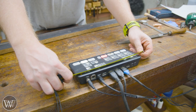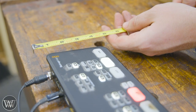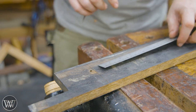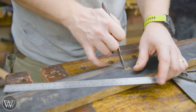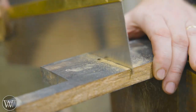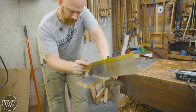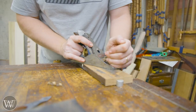So I need to make it three and a half inches tall. How wide do I need to be? I need it to cover the ATEM Mini, but I also need space for pieces on either side, and I want those legs to be a certain distance long. It's basically going to be a three-sided box that covers it up. We're going to make it out of White Oak — specifically some 100-year-old White Oak. This came out of a desk I saved from a pile a long time ago and I've been slowly using it. 100-year-old White Oak quarter sawn — really beautiful stuff. I'll cut it to length for the back piece and two side pieces, making the sides long enough so there will always be enough weight that it won't tip over, but not so long that they take up bench space.